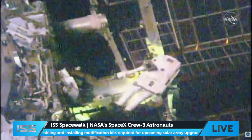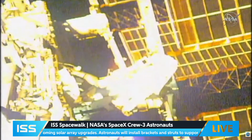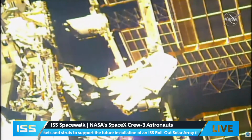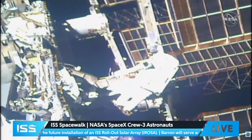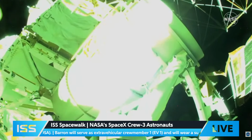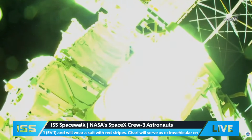Torque, but I wasn't in a great body position at the end there, so I'd like to give it another go, if you agree. Counted 9 turns. Okay, I think I heard 9 turns with a low torque, and you have a go to hit it again. And I got a green light, 25.4, and that was maybe half to one additional turn, and I'm going to get in a better position to tell you black line. Copy, half to one additional turn, so I'm showing 13 and a half to 14 turns with a green light, and you're checking the black line now.